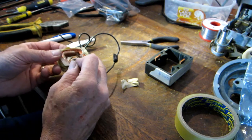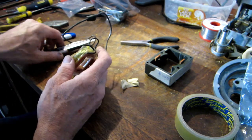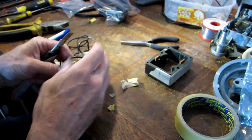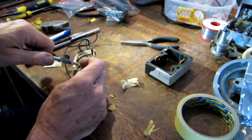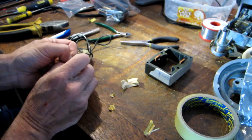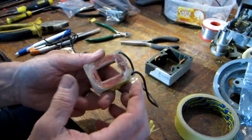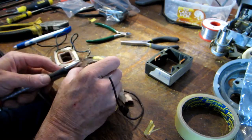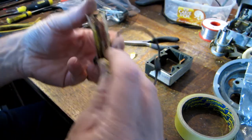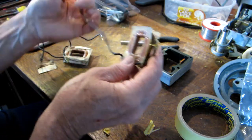These formers are in quite poor shape — I need to try and preserve as much of that as possible. But first I'll see if I can remove this yellow tape from the outside. With that piece of tape off, I can disconnect this wire termination. I'll try and keep as much of that plastic as possible. You can see this wire comes from the centre of the coil. Here's the other termination wire — and even this must have got very hot because the insulation on this wire is all melted as well, so it's going to need some new wire too — not the end of the world.